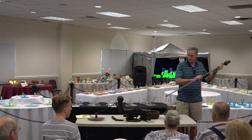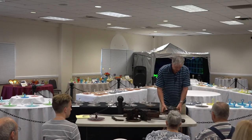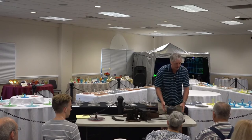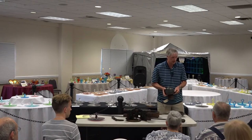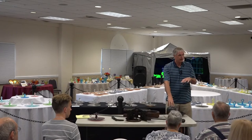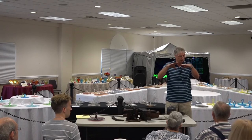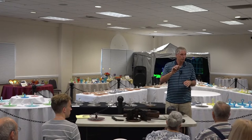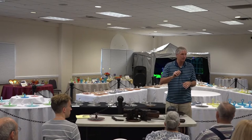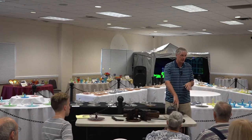is important in the process is that when you look at the way the ring and the plunger fit together, there's actually a flat side of the plunger here down at the bottom, almost flat, meaning almost vertical, right down in this area, so that if there's a little more glass, the plunger will not go down as far, and yet it'll still close the top of the mold off. If there's too much glass, it'll work up a little bit. So there is room for the size or the weight of the piece to vary. They don't have to be exactly right, but they have to be close. So there's a sort of self-adjustment process or design built into the mold.